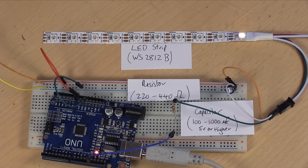An important point here to consider is when you have the Arduino plugged into a power source, as we do now, the power line runs to the V-in of the Arduino, you shouldn't also plug it into a computer at the same time. So we're about to go into the Arduino IDE to do some programming, so just for now, remove the V-in wire from your Arduino, plug in your USB port, and open up the Arduino IDE.